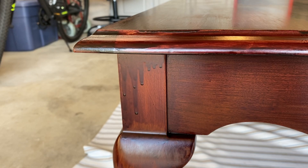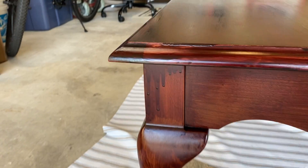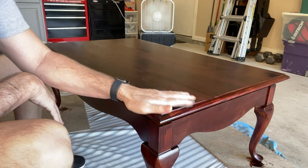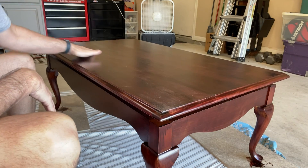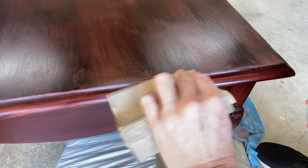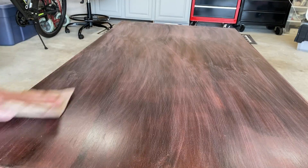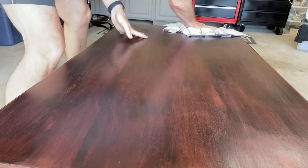The next morning I looked at it again and it actually does look better. However, I still see a lot of starts and stops where my brush went, I have some drip edges, and darker areas on the waterfall section that really need addressing. I'm not satisfied. So I got my steel wool out again and sanded it, but I shortly realized this wasn't going to be enough. I used a piece of 220-grit sandpaper to tackle those drip edges, then decided to do the whole top, wiped it down, and it's looking a bit better.